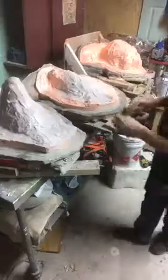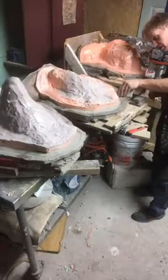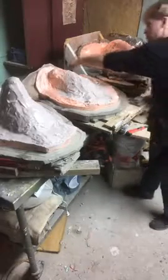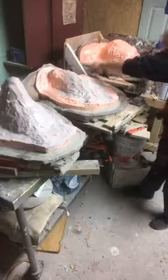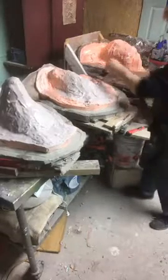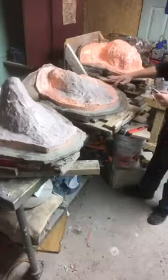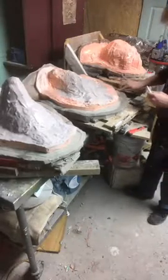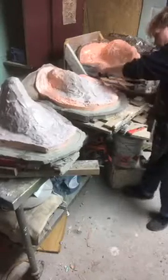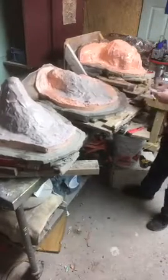All right. So I've got my mold wall pretty even here, and I just put my square block. I'm just going to kind of smooth it so that it's even. I don't have to worry about hurting my mold because it's silicone, right? At this point, not the actual sculpt, where you've got to be careful. I'm just going to square it right up to my silicone. I do want it to be as square as I can to the silicone, because when I have the second side, I want them to fit and not have a weird gap. But I don't have to really worry about hurting my mold here at all, trying to square all this up. So I'm being a little rough and just trying to get it even enough to mold.